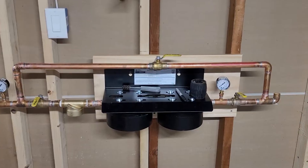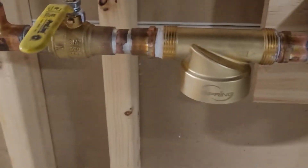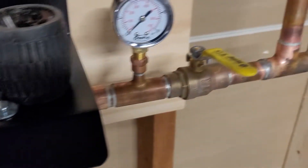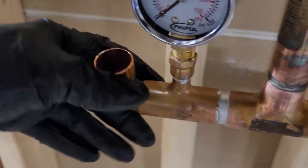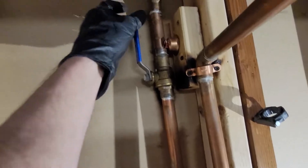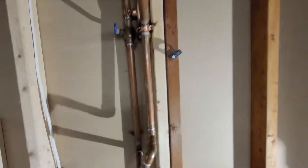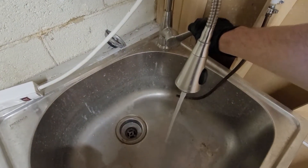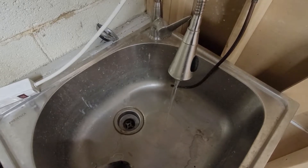This is basically the result of day one. I've given myself the whole day for day two, just in case, because once you cut into a water pipe there is no going back — you have to finish the job. Start by draining all the water out of the pipes: turn on the faucet at the lowest point of the house and also at the highest point.